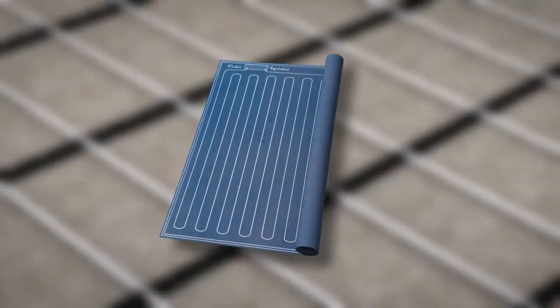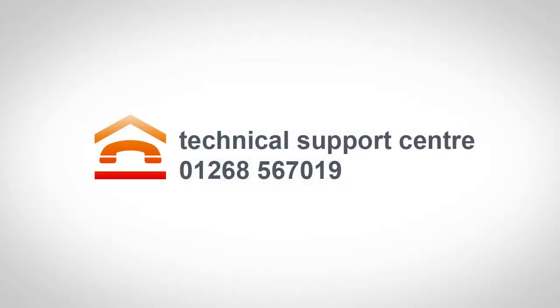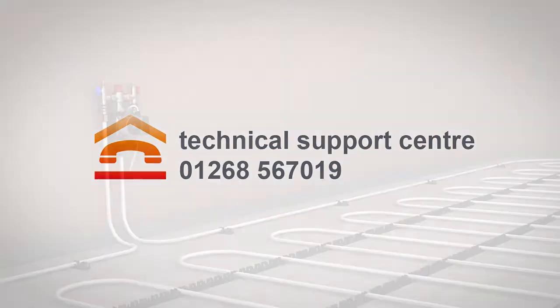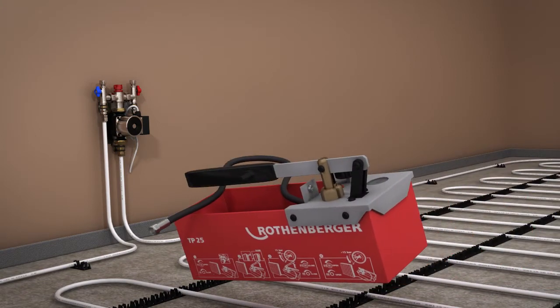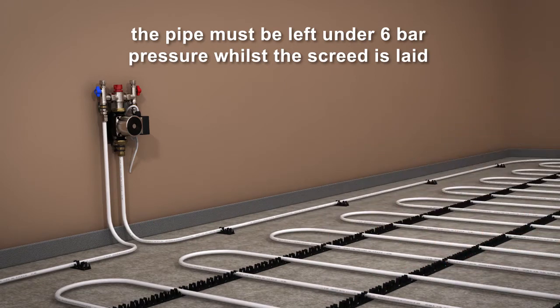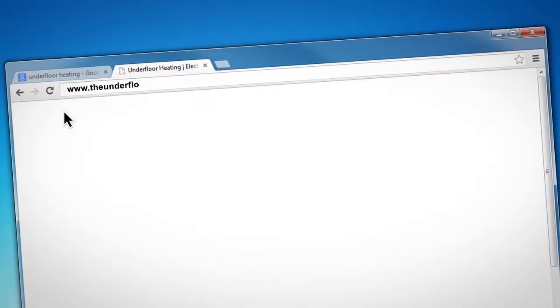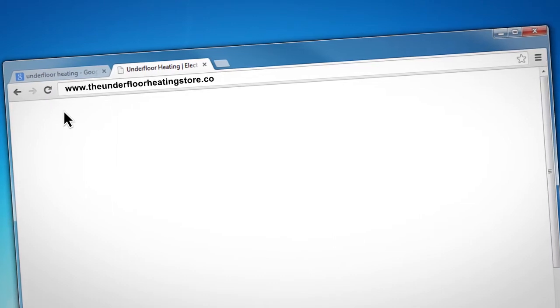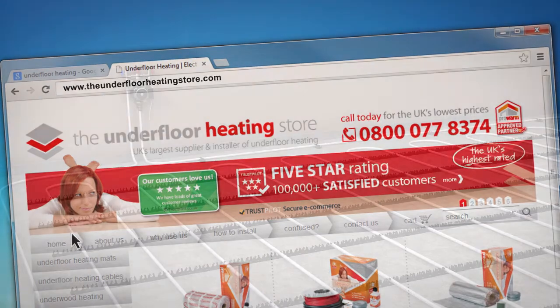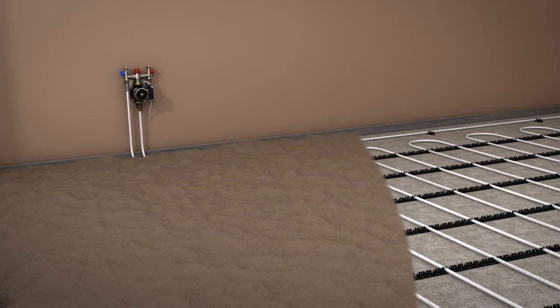Your installation pack may have been supplied with an example diagram to assist in your planning of the layout. If you are in any doubt, contact our Technical Support Centre for advice. The pipes should be filled and pressure tested prior to screeding and left under 6 bar pressure whilst screeding is carried out. Please refer to our manifold and pump videos found on our webpage. Screeds should be laid immediately after pipe laying and testing to ensure that it does not get damaged.